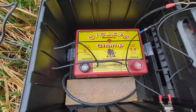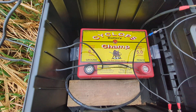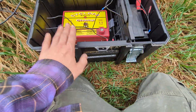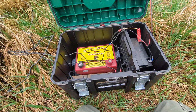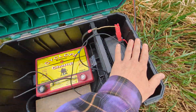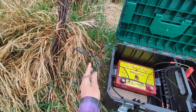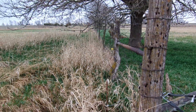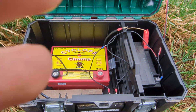These Cyclops chargers can be found a lot cheaper on eBay than from a local dealer — though consider whether you want to short-sell your local dealer since you may need them in the future. Full disclosure: I did get this one off eBay. The battery is just from Walmart and the toolbox is just from Menards — I brought everything to the store and stood in the aisle making sure the toolbox was wide enough, had a reinforced top, and fit all the components. The two leads from the charger just splice into the fence and to a ground wire leading to one ground rod here, then uses the barbed wire fence to connect to another ground rod about 100 feet away. That's the same setup I use at both remote locations.